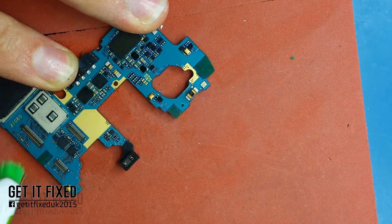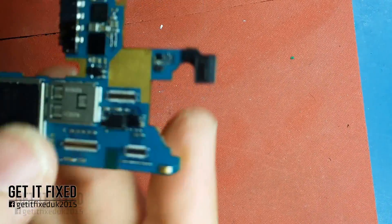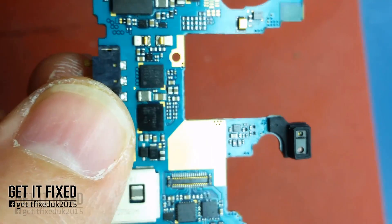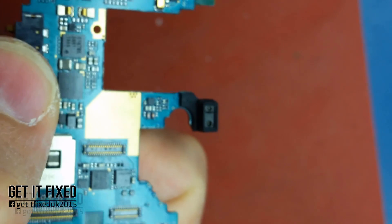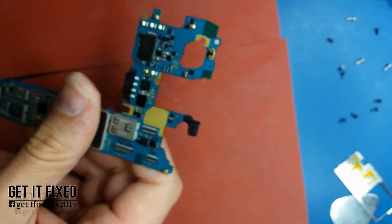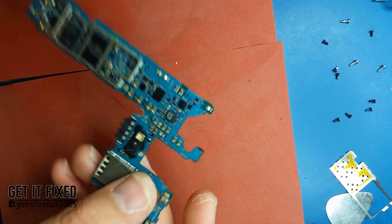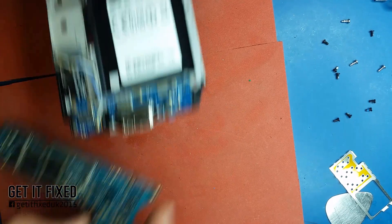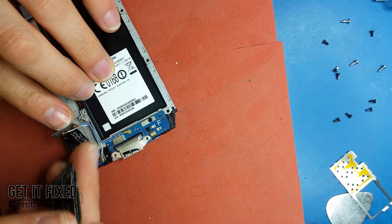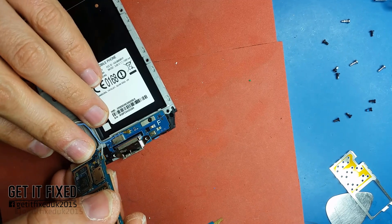After the reflow I clean the board. I'm using Falcon 530 — it's a contact spray cleaner. There are plenty of other sprays; I think CG22 is even better than Falcon 530, though it's more expensive — it's a German product. That one was specially made for board repairs.